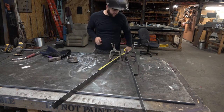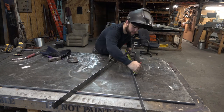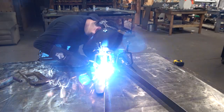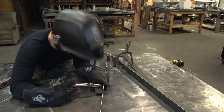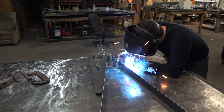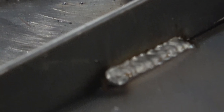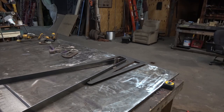Whenever possible, if using welds that are going to be visible and almost a statement piece, I actually like to mark out where they're going to be. That long run is about 32 inches, so I'm marking two inches in from the end and then I'm going to straddle that middle mark by two inches — making a mark at 15 and 17 — and that will tell me where to put my welds. Make a tack at each of those marks while you can see them under the helmet, then start welding. With a standard Sharpie you'll have a hard time seeing it with an arc lit, so tacks at either end give you boundaries to weld within and you get nice, even spacing that looks very intentional.